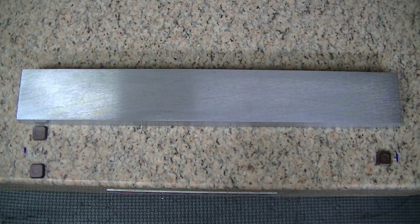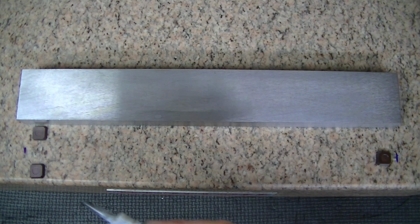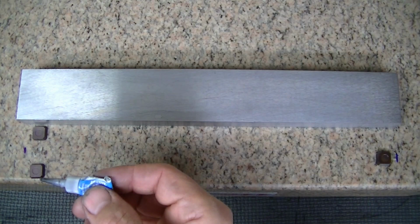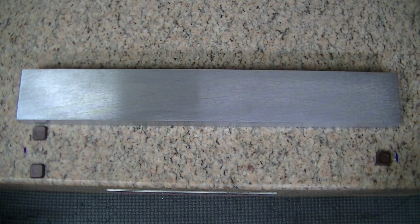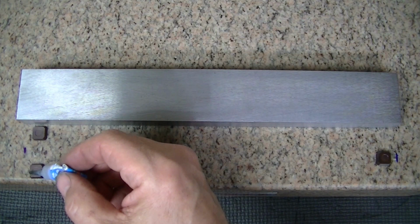So here's an easy way to make this. I go over my stock rack and look for something that's ready to go. I find a piece of precision ground stock ready to rip so that it's reasonably parallel. I get four worn out inserts that are flat face inserts, no relief grooves, flat on the other side. They conveniently have a little pocket in the back to hold my Black Max 380. And they're on the surface plate, which is a good plane. So when I flip this over, the plate's going to basically hold them flat, and I'm not going to have to lap these for the purposes of what I'm doing. I have a magic marker mark here and here. I've already measured the distance between these and set them at 11 inches. I've spaced these for the distance between them. Got a drip of Black Max ready to fall off there.